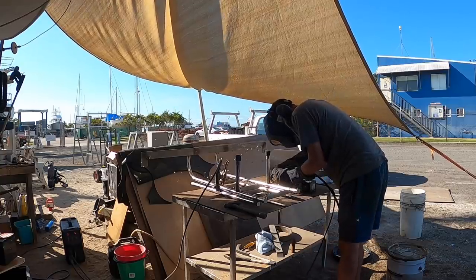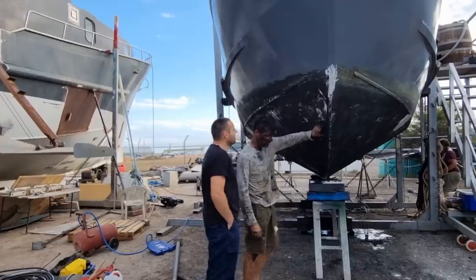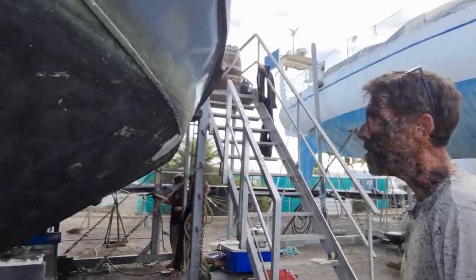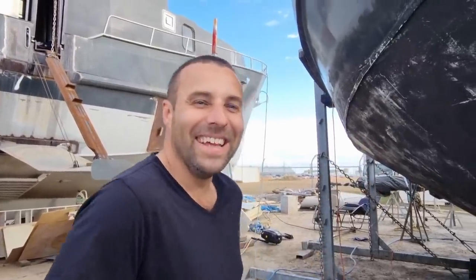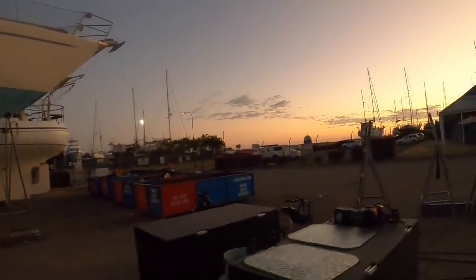After that, I moved on to repairing the swim ladder, which is something I'd broken quite a while ago. The fun job after that was wet-sanding the old antifoul off. T-minus two days now and four coats of antifoul to get on. Got the old antifoul sander just today. Just going to mask up the waterline, start painting. Still early — coffee first, sun's coming up, then we'll get into it.